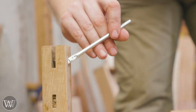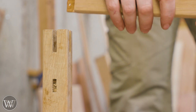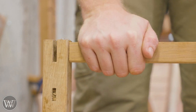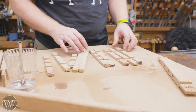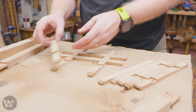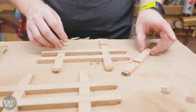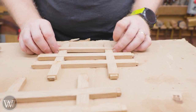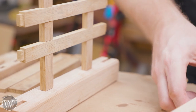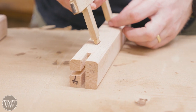For the top I need to put the stretcher between those two pieces, but for the two sides I decided to assemble those as separate units and then put them into place. I put the top stretcher on between the back two legs and make the individual panels one at a time. This is the tricky part because there are four of one and six of the other — I need to make sure they're the right ones, which is why I put numbers on them. I put a little dab of glue between each one and did a quick dry fit to confirm they went together the right way.